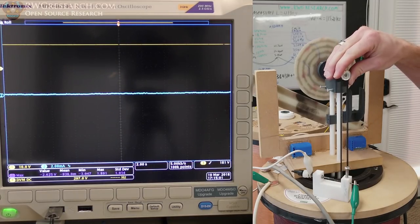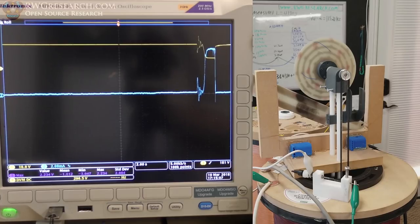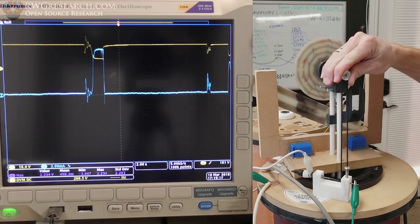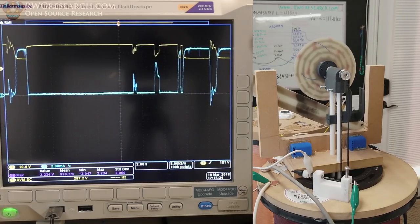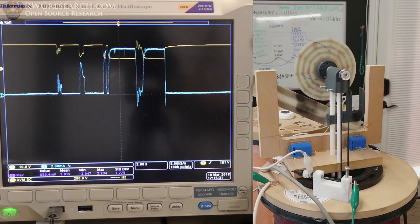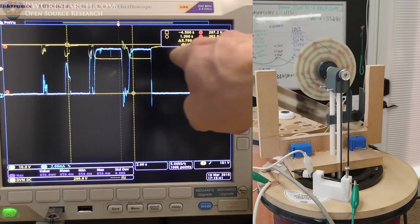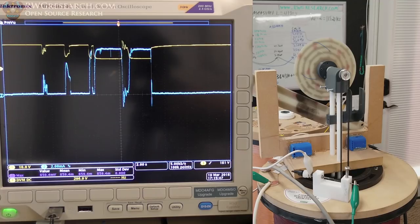Okay, so here we go again. You can see that the battery voltage and the current both agree with each other. Now, let's see if I can hold it back. Hold it right in the middle, I might be able to. There, right there. So it's full current. You can see that the current is completely canceled and the battery voltage goes almost up to where it was. Let's move one of these cursors up here, one down here, just to get a reference of where the zero line is. You can see the battery voltage actually dips a tiny bit above. Not so impressive, but interesting nonetheless.